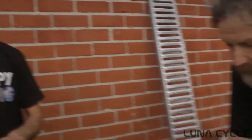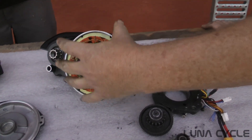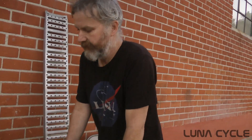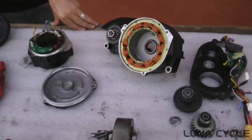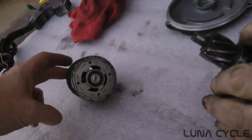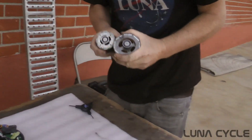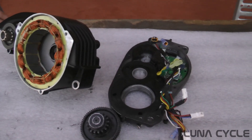By having a larger diameter rotor, it's basically applied leverage. Motors like to spin fast, and when they're larger like this they're spinning faster by nature — it basically makes it like a bigger motor without adding all the weight by making it narrower. The whole unit is two pounds heavier than the HD, but it looks like a considerably bigger motor. Look at the difference in cooling ability too — look at the holes in the ends. A lot better cooling.